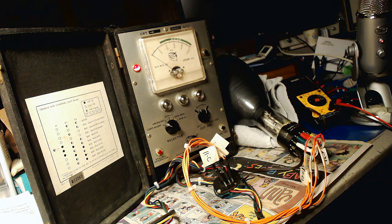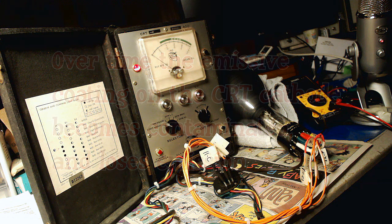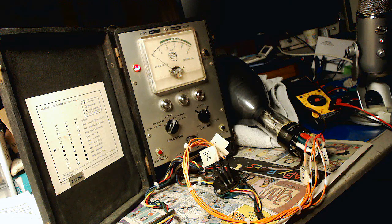This tester is also a rejuvenator, where you can set it and then zap the filament. But before we do that, he said to try one of these other settings — put this on DYN medium and let it set for about an hour. This increases the voltage to the filaments and sometimes that might clean it up. The filament should be a lot brighter — and it is. There's a shot of the filament glowing. We'll leave this set and come back to it after a while. He said after an hour we can put it back into the TV set and see if it's any brighter.